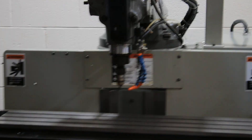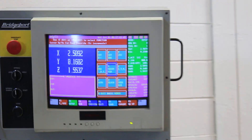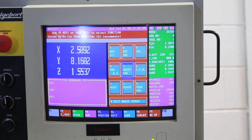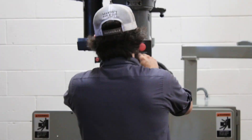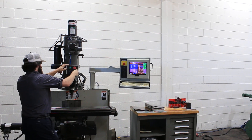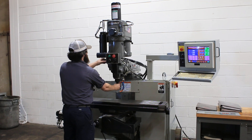And you can see that on the control — the variable spindle speed shows up on the control. So you have a variable spindle speed displayed on the control, 30 taper power drawbar. The machine also comes equipped with the coolant pan and the coolant pump. Right now we're going to run the spindle up and down through that digital hand wheel. You can see he's moving it — the Z axis on the control is changing. So you have both a rapid and a fine feed knob, and also obviously programmable through the spindle.